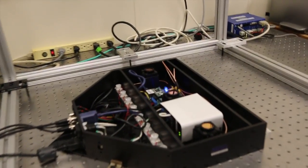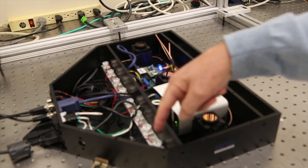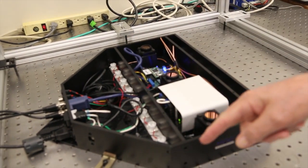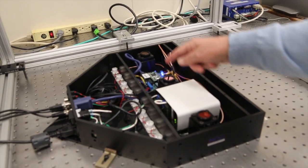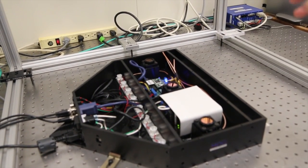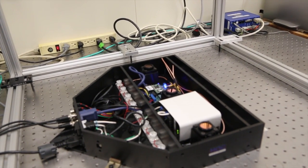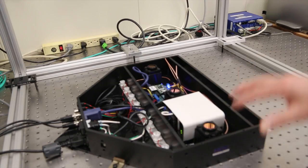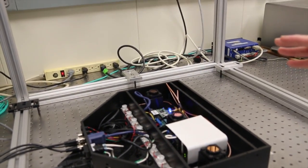If I take the cover off, you can see the inner workings of this device. There's a line of light-emitting diodes here, and there's a line of light-emitting diodes here that emit very intense, eye-safe infrared light. And there are three photo detectors. The rest of what you can see is the electronics. There's a miniature radio in there for communicating the observations to an external person.